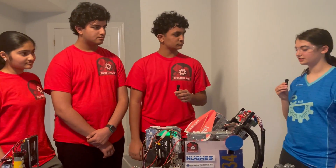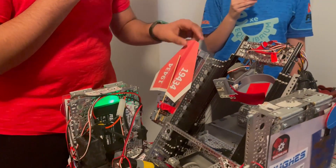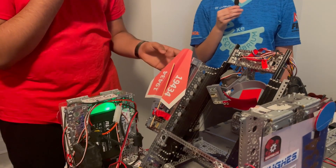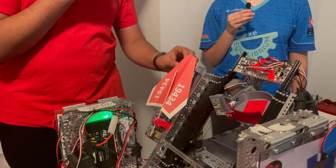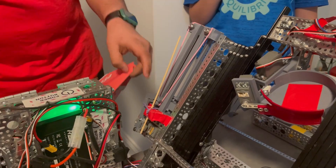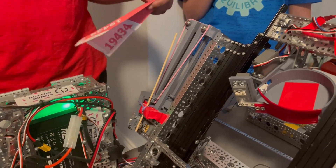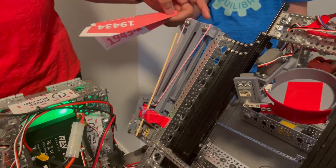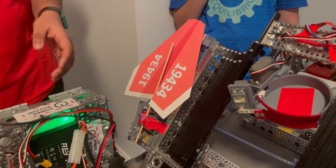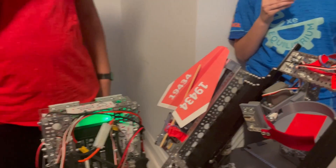Can you tell us a little bit about how your drone mechanism works? Our current drone mechanism is one of our first major iterations of our drone launcher — it's custom designed in-house and consists of three parts: the main rail, the launcher bit, and a lid. The rubber band comes from the rail through V-guides and back, which reduces tension on the rubber band and increases its longevity. In the future, we plan to reduce the width and improve it so we can get a lot more reliable launches.